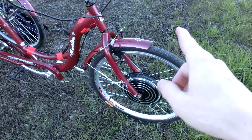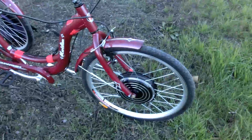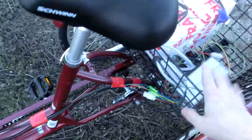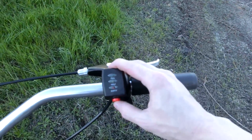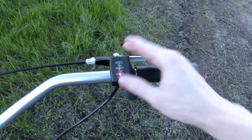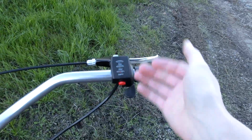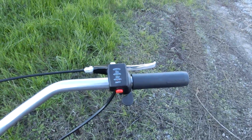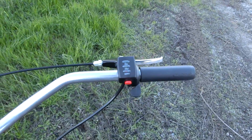The first one I bought in around 2013 was okay, but it had some features I wished they'd fix — and they did. Like one thing: this cable was too short on the first one, but they seem to have lengthened it to where it fits nicely going up and down all this stuff. They also made it so the LEDs turn off whenever you turn the thing off, because before I had the issue where I accidentally left it on — the LED stayed on and that 200 milliamps of current draw killed my batteries over three months because I forgot to use and charge them.